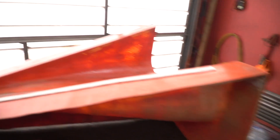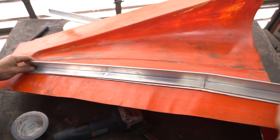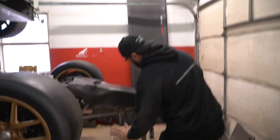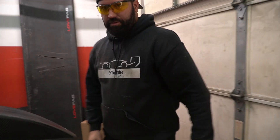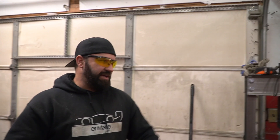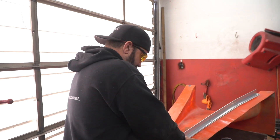What I'm doing here is doing some loose tooling so that way we can build a lip as part of the infusion, where the lower nose cone comes in. There'll be a lip that goes up inside here so we can fasten the nose cone to the lower cone. This needs to come off to check brake fluid, do all that. If we've got to do anything with the wing, we've got to be able to pull this off. So we'll do some quarter-turn fasteners, do it quickly. The last time I had to rivet a piece of carbon on the end, it was just nasty. So I'm trying to make a little bit of effort now to make it nicer.